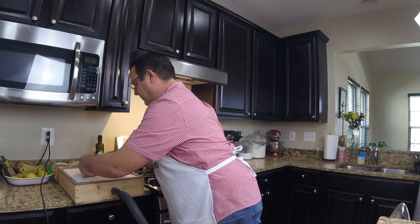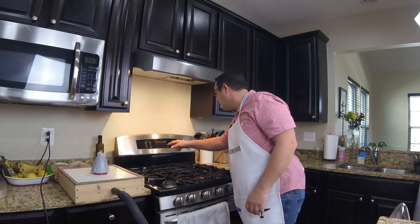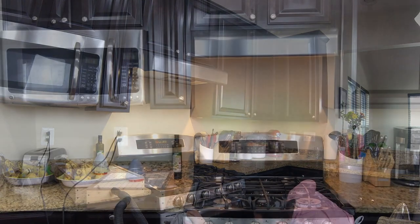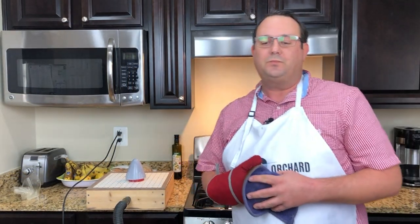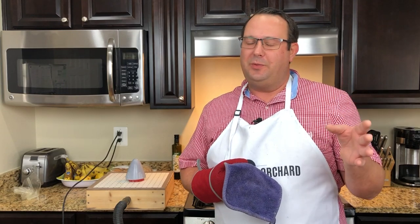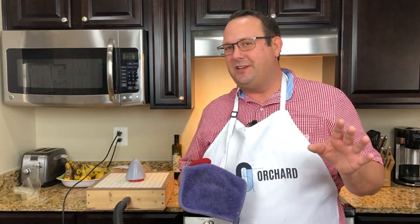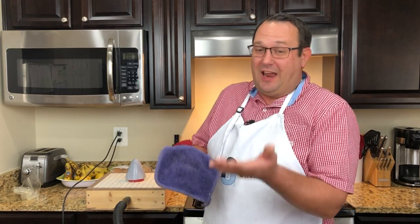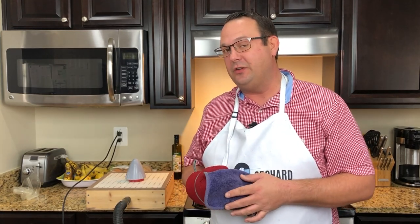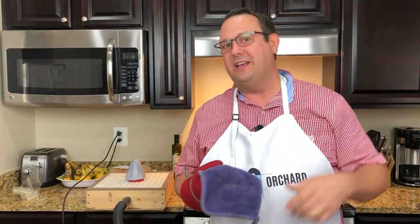While our plastic is baking, a couple of things to note: if you get a plastic that is a little bit too thin, you have a risk during this softening stage where hot air rising in the oven will get trapped under the frame and keep the plastic from sagging. That's a disadvantage because you want to be able to tell how soft the plastic is before you pull it out. You can try doing a relief hole on the frame to make sure it's not completely airtight under there, so something at the highest point can relieve some of that pressure.